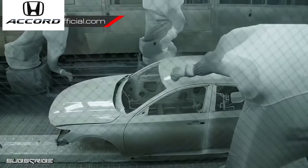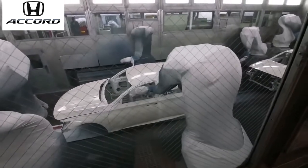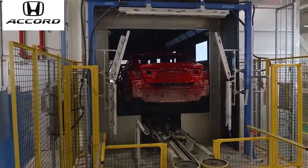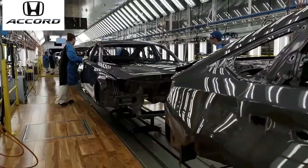With the introduction of our new line, we have something that's unique to the auto industry, which is our 2K primer. It's actually a two-part primer process. We have a resin and a catalyst that get mixed before they get applied to the car body. So this is brand new technology for our industry. We also have an auto inspect booth where we have robot-mounted inspection that comes out and inspects the car. Then that feeds back to the associates where defects are for the inspection process. So both of those are very unique to the auto industry.